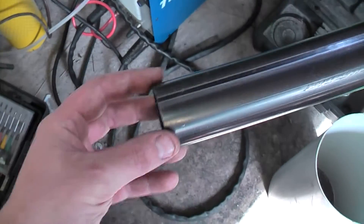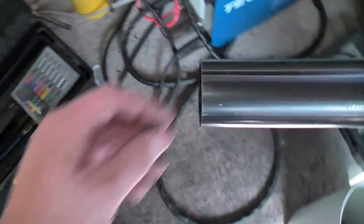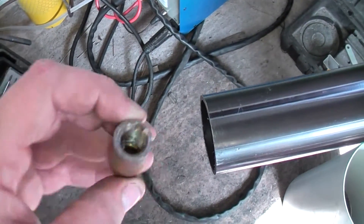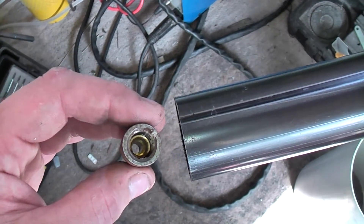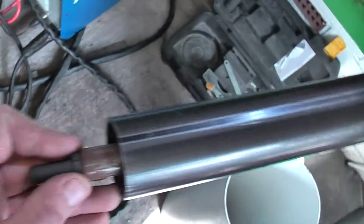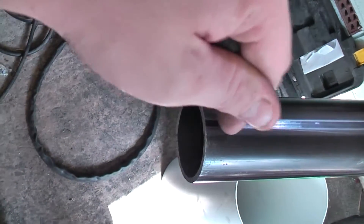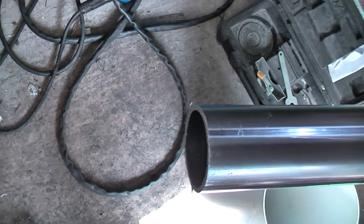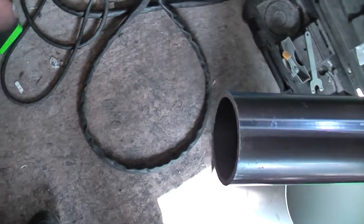What I'm looking to do for the burner is use a small brass bolt — I've got a fitting with a small brass bolt tapped out with M6 so I can screw a welding tip in there to use as an ejector nozzle. That'll be mounted by drilling and tapping some threaded bolts through there, and it'll connect to a propane gas regulator so as the propane fires at the end of the tip it'll draw air up the tube.